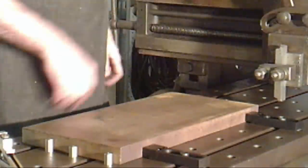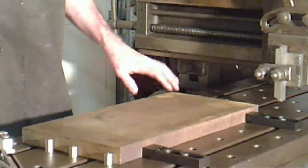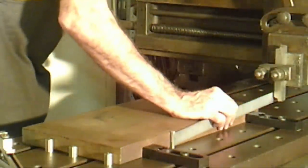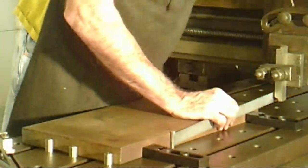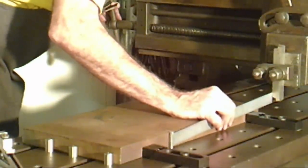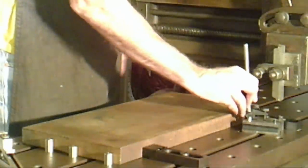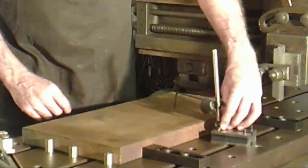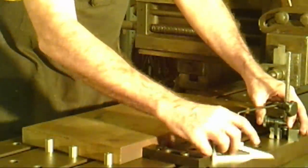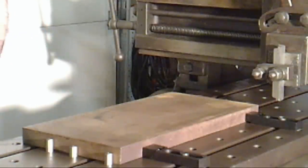With this tool, the clapper set straight or just a little bit over is fine because of the design of the tool and because it's such a shallow cut. The last thing to do is get a rough alignment of where I want to start the cut. With the gears out, I'll just move the tool over so that it's just about even with the start of the work — so we'll have a few cycles without any cut. I can take the surface gauge and adjust it along here so that as I move around I'm just touching. It's my shaper tool — same light touch. I'm happy with that.